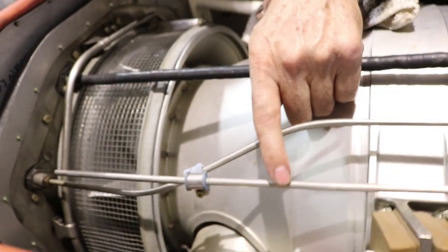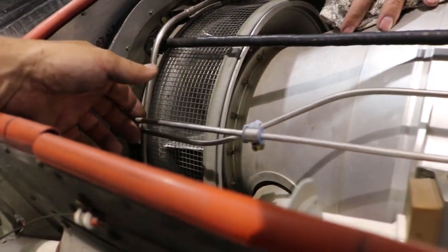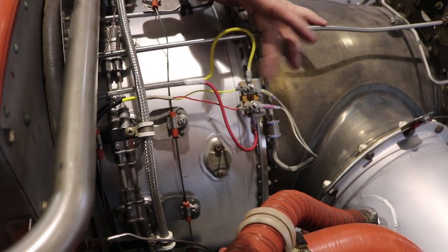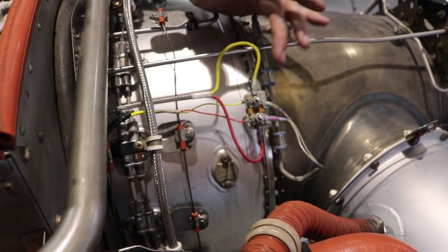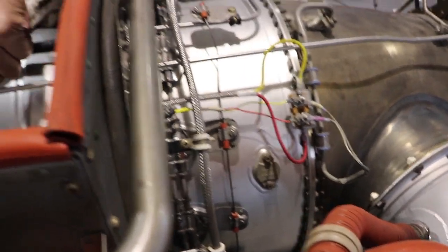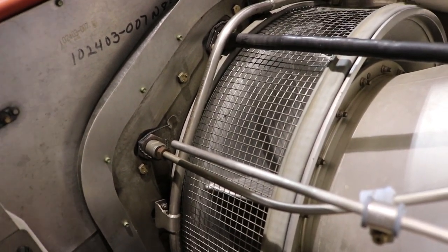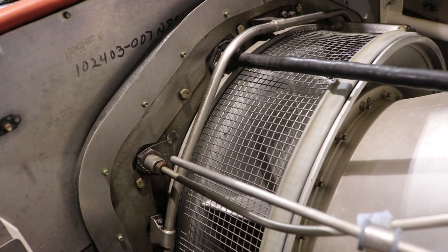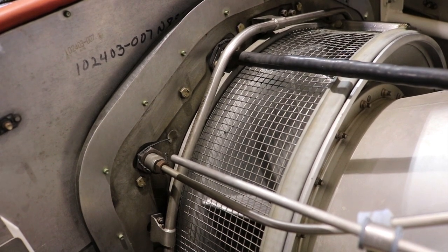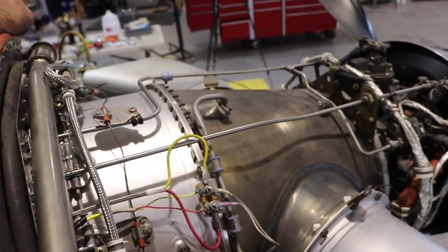This is the trim stick. What this does is put a resistance into your turbine inlet temperature rings hooked on here. Every engine runs at a different temperature. To provide commonality between all engines of the same model for the pilots, they change the resistance of this trim stick — so it gets shorter or longer. Say if you're running at 1,600 foot-pounds of torque, you'll have a certain ITT temperature. The factory doesn't want them running at all different temperatures, so different resistances in these trim sticks — after you do your run-up and power everything up — will make it seem like all the engines are running at the same temperature, when they're really not.